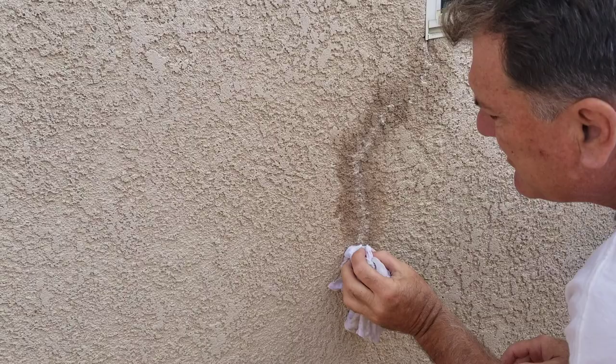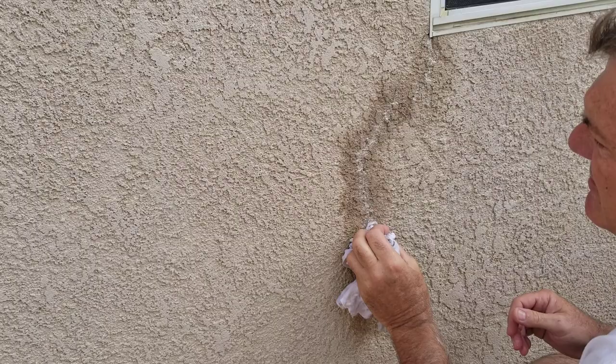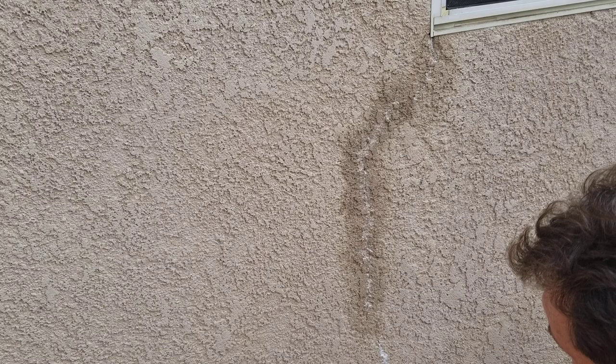Let me get back so you can see the bottom of that. That's how I fix cracks in stucco. See how much work it is to do one crack — it takes a long time. I can see it's a little bit wide down here so I may not even try to get the whole entire crack, just the visible areas. My guys never do this the right way even though I've shown them repeatedly. You see how much agitation you've got to put in — I'm pushing on that rag really hard. When that's painted it won't shine. You've probably seen those shiny cracks.